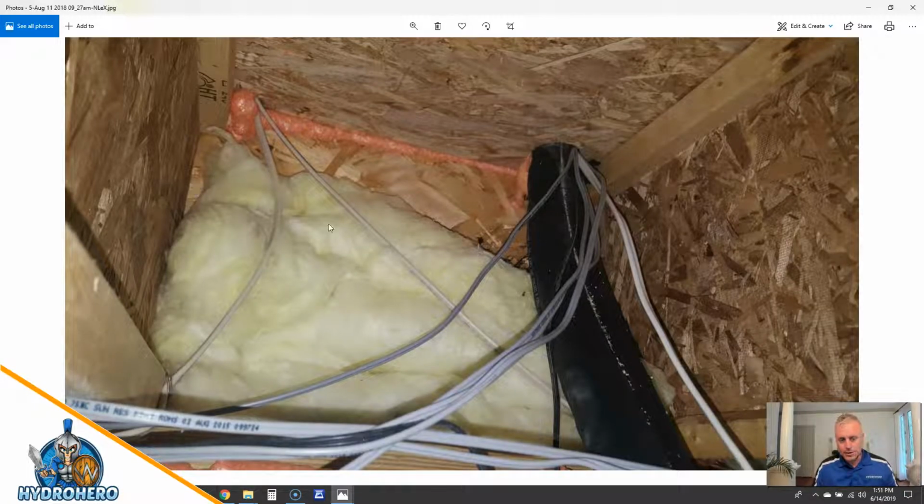So here is the insulation. The only thing that we don't care for is spray foam insulation, whether they used EPS, XPS, or some other rigid foam board, or batt insulation. We're okay with that. And some companies aren't. We are. From a moisture control aspect, you can pull this back. You can look and see if there's any mold growth or anything of that nature there. You spray foam this and you don't see anything until there's major rot there. So that's just one of the reasons.